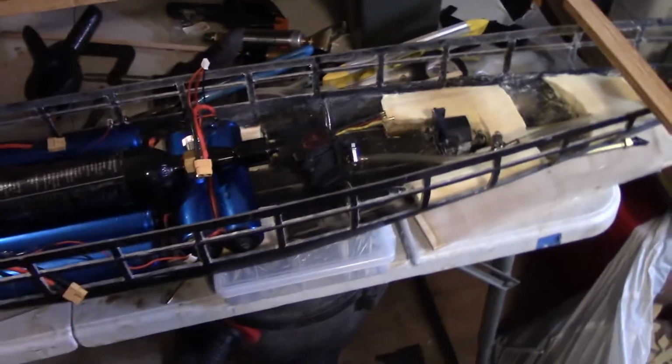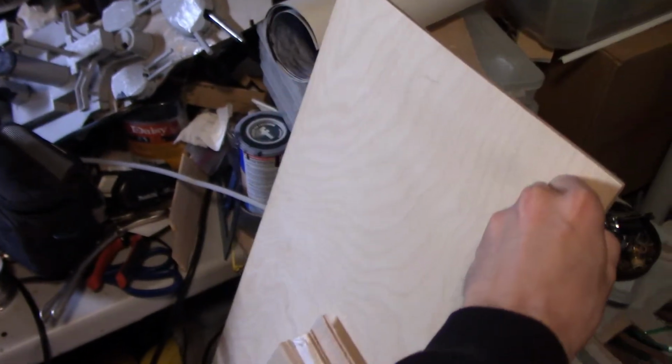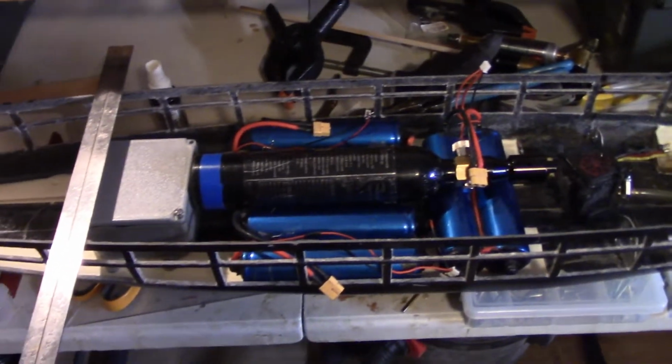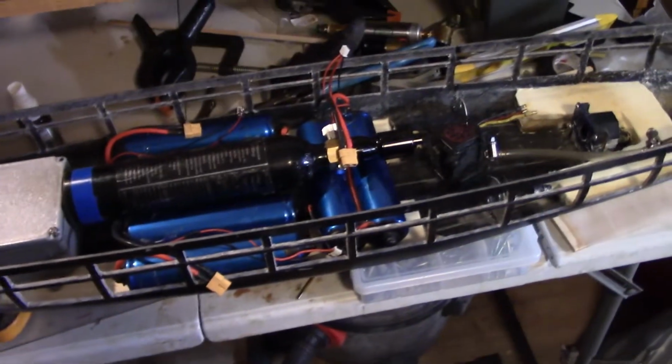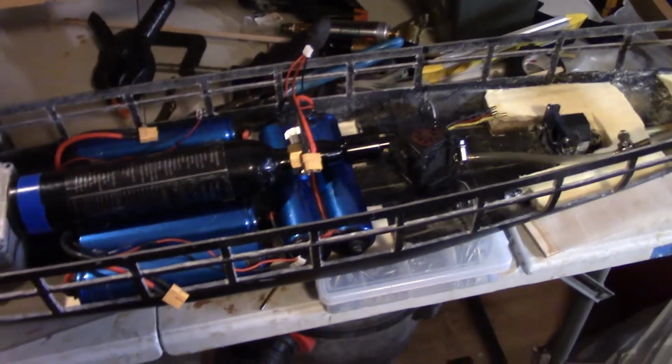So the general process here, the material I'll use will be aircraft grade plywood. This is a 3/16 inch, 1 foot by 4 foot piece of plywood. I'll also use some of those bigger pieces in the back there, because I have 1/4 inch, 1/8 inch, and 3/16 inch. The general process will be tracing out the hull, tracing out the subdeck and the thickness and the cross members, cutting that out, and then repeating the process for the deck.